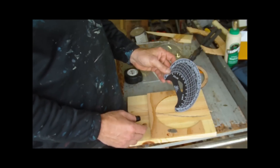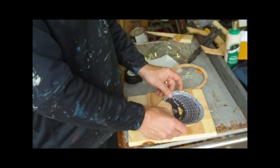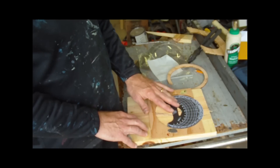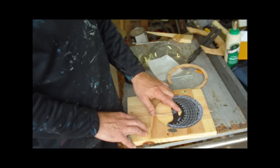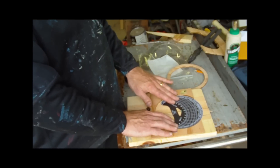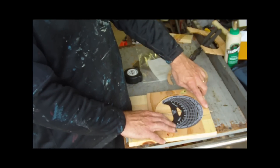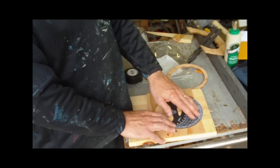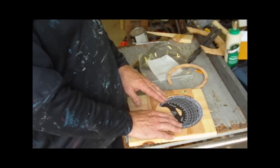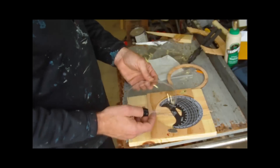I bought from Solar Pathfinder this template, and this is for my latitude, so it sits in here. It's the one that was seven inches, and I've actually installed a pin on the center line, so that this can rotate around on that center line. Up here, the center line that I drew on this board extends above, because there's a magnetic declination adjustment that needs to happen. In our case, we're 16 degrees east, so I can turn it 16 degrees.